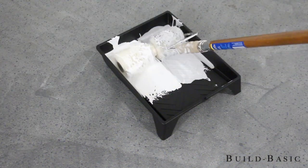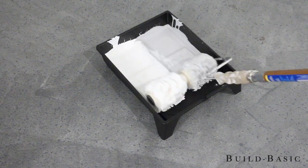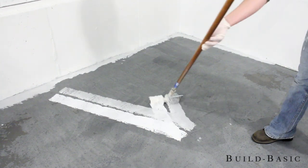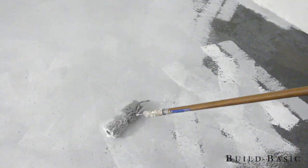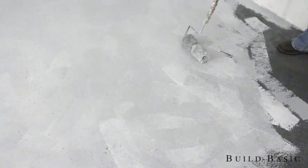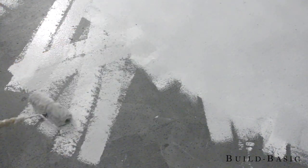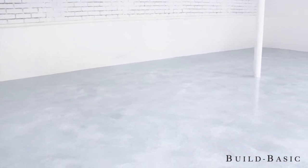Next, we loaded the roller from the paint tray, always placing the roller back in the tray in the same direction so the colors don't mix. I started rolling and immediately realized my passes were way too long. I quickly started working in shorter passes of about 6 to 12 inches, often flipping the roller and changing direction to create the marbled effect. We worked our way out of the garage with one person finishing the rolling while the other mixed pouches from the next kit.